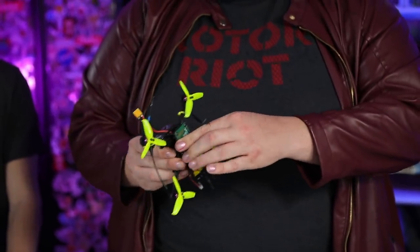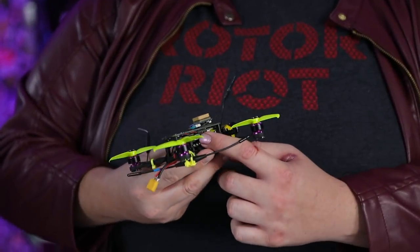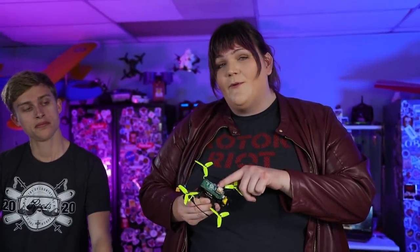The frame is built around the Raspberry Pi, so with this battery pack and the Pi, they're almost built for each other. We have an M8Q583 GPS on top, which tells the iNav board below where it's at in the world. On top of that, we have a barometer, accelerometer, and gyro — all the things you come to expect. This allows the iNav flight controller to fly autonomously, but it isn't just autonomous. Flip a switch and you have full acro, which is amazing for a build like this. It kind of does a little bit of everything.